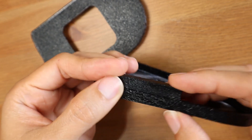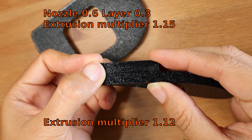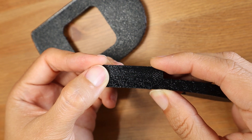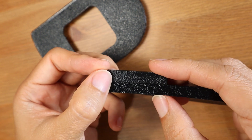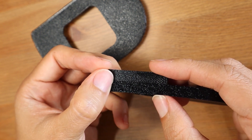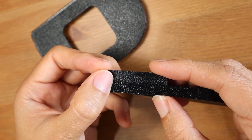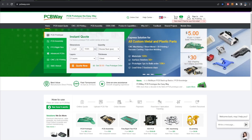The preset was 1.12, so I decided to try printing at 1.15 to see how it goes. Here is the result — it's already much, much better. So I have some hope in this direction. Rather than printing a separate piece for every single flow rate, I want to make a flow rate test tower, like a temperature tower but for flow rate.